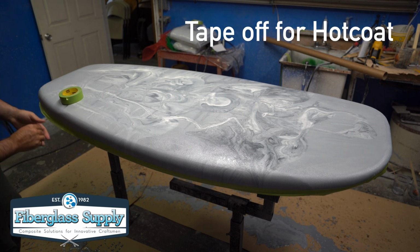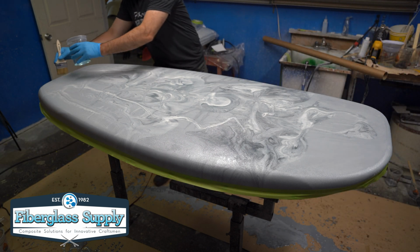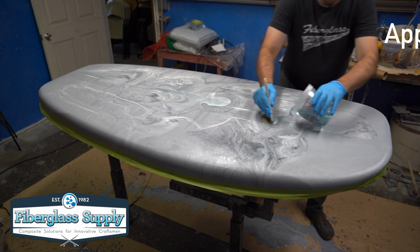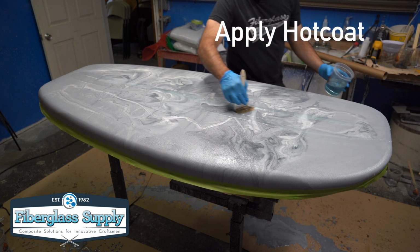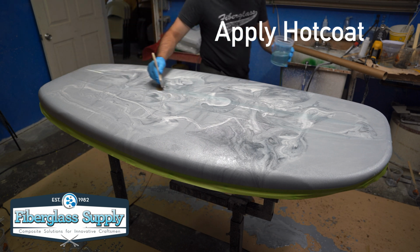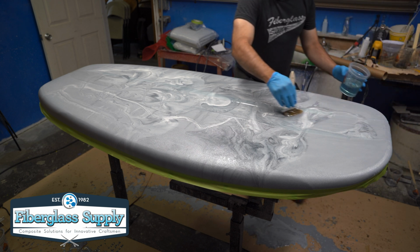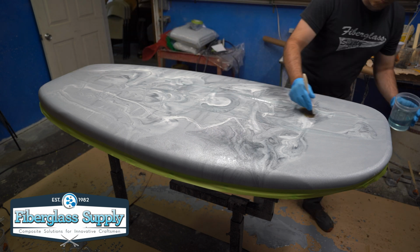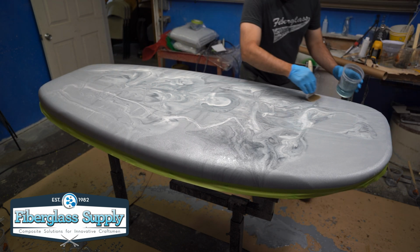From the epoxy boat building world, they tend to call it fill coat because it's the coat of resin that fills the weave of the fiberglass. So my technique here is generally pour a bead of resin down the middle and then use the brush as a squeegee. You can see how hard I'm pushing on that. The bristles are pushed out there and down. So I'm pushing pretty hard and work that bead of resin towards me and off the rail. We want to make sure we get enough resin that we work it off the rail and over the tape.